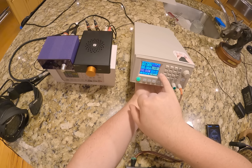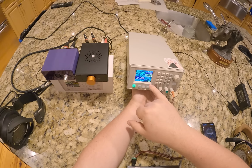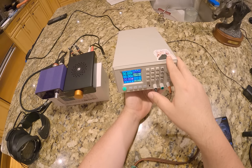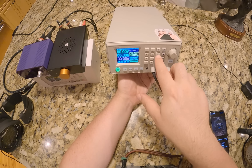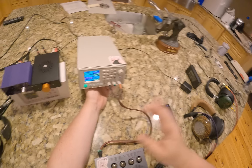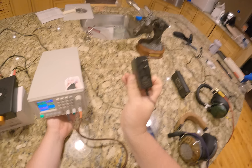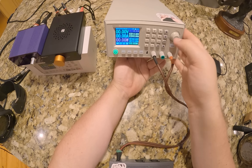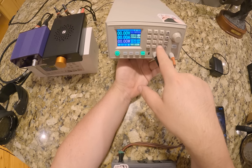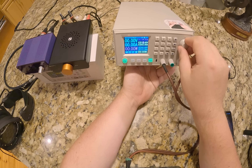Before you hit the output button, check your inputs: currently 65 volts from the MIG transformer inside, voltage set to 12.6 — slightly higher than normal — and 3 amps, which doesn't matter since it's never drawing more than about 1. Over-voltage protection is set to 62 and over-current protection to 12, and it'll actually handle up to 70 volts though you're not supposed to run more than 60. You have all sorts of memories you can reload. You just give it an eyeball check: am I about to blow something up? This needs 48V, this needs 12V, this needs 12V — you don't want to mix those up.